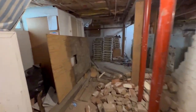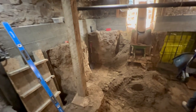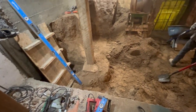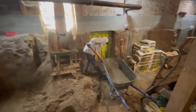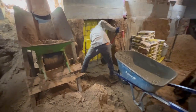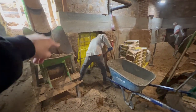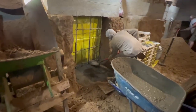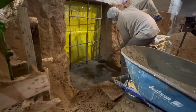You can see here some more progress — a lot of progress over here. They dug down a good two more feet; you remember this wasn't as deep last time. They just got done pouring a footer right here, so this is the first time you've seen this in person in real time. We pour the footer slab first, and then once that's cured we'll prop up the walls, put the forms up, and pour the walls.